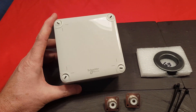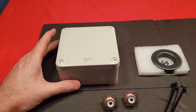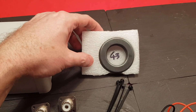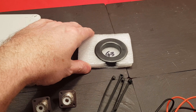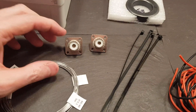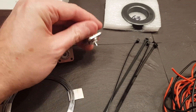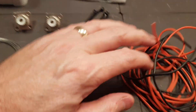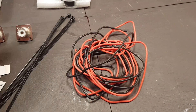First of all we've got the installation box — this is what we're going to mount things to, and it's going on the chimney on the roof, so we want something weatherproof. We've got a type 43 ferrite ring — type 43 will do the job nicely for 26-27 megahertz. Some SO-239 sockets, solder, cable ties, and this high-temperature resistant silicone wire, 18-gauge. It's important to get the right wire.